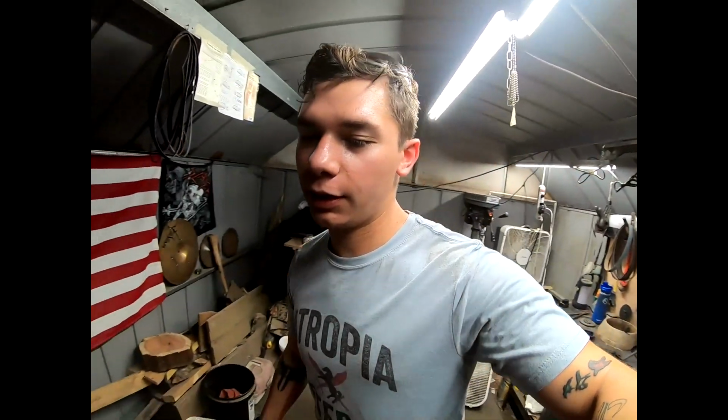So while we're waiting for that etch to finish, I want to go ahead and explain what the next step is, and why we're gonna call it a night right here. So I have to temper the blade. Right now it's too rigid, it's much too hard. So if I were to drop that blade, it would shatter just like glass.